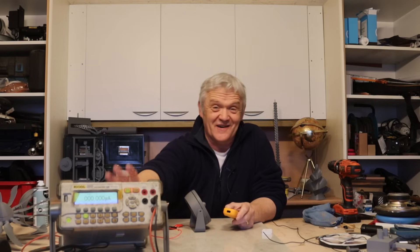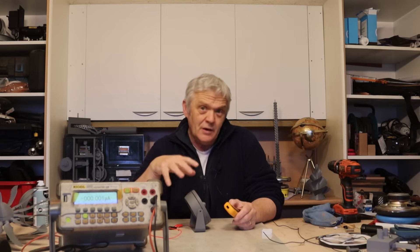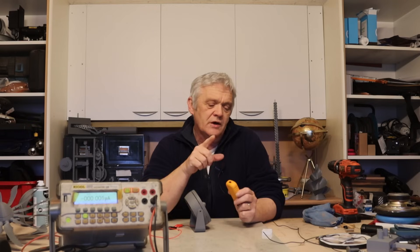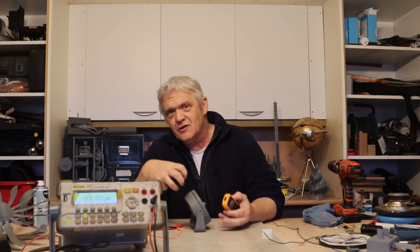I have to keep pausing to go and check the numbers, but it was 2.1 meters per second and I would say it was around 153–155 milliamp draw while it was running. So it's a lower amp draw — remember it's three volts throughout — lower amp draw, and we've got a slightly higher wind speed from adding the tubercles.